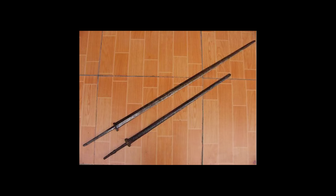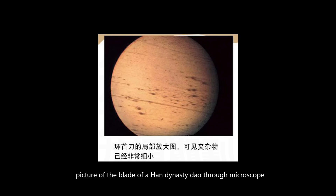Let's talk about how the sword was made in the Three Kingdoms era and Han Dynasty. The technique of folding the blade of the sword when forging is already used by Han Dynasty Chinese, and they call this method Bai Lian Gang Fa. It was considered a method of making steel at the time. What they did is they use pig iron, which Chinese already knew how to reliably produce in large quantities at the time, or cheaper wrought iron. The blacksmith would continuously heat and fold the metal when forging.